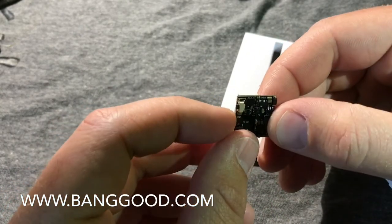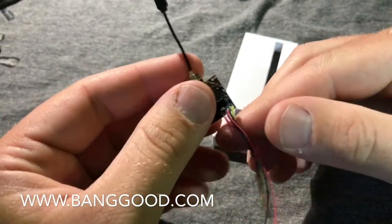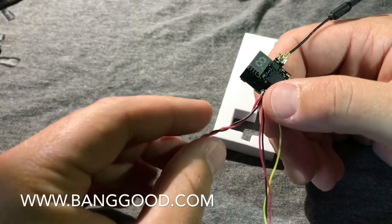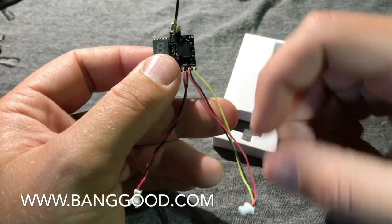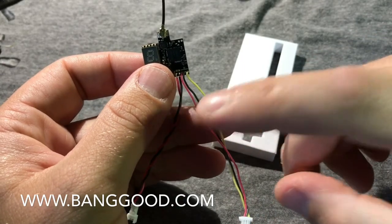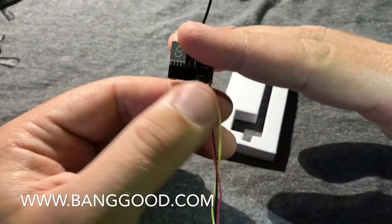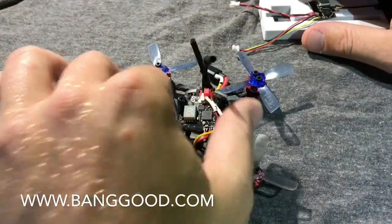You've got your sleeve dipole antenna on top, your little LED indicator screen, your switchable button, and then your outputs. Your input power goes to your 5-volt power supply on your flight controller or PDB. Then this connector goes to your camera — positive, ground, and video wire. Real nice little setup, everything right in one place.